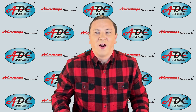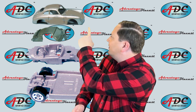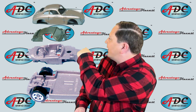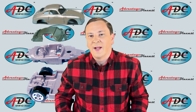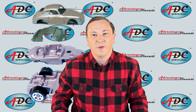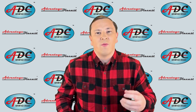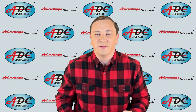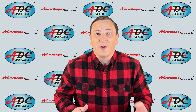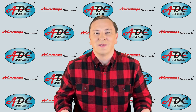The inexpensive mass-produced runs I'm talking about are in thousands to a hundred thousand or more pieces. They're often made with just four parts: the die cast body shell, the clear glass part for the windows, the interior part, and the undercarriage part. The undercarriage arrives at the assembly line with four tires and two axles already installed, so assembly is very fast — just put four parts together and it's done. The more expensive die cast cars and trucks will often have individual front windshield, side windows, and rear glass pieces. This makes a much finer model but adds more assembly time and cost to both manufacturer and collector.